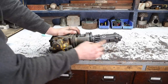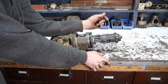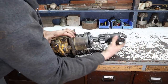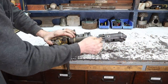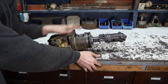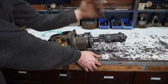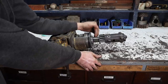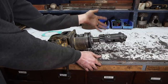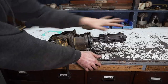And the way that it disengages from the pony motor is, once it is spinning at a certain RPM, the centrifugal force releases these knobs here, and then that kicks out, disengaging the pony motor from the diesel. And then you can shut the pony motor down and just run the machine with the diesel. And so then, while the machine is operating and the pony motor is off, the flywheel rides right here in this gap. And so that's basically the exact spot, because it has to be able to get in there and spin freely without contacting anything on the pony motor.